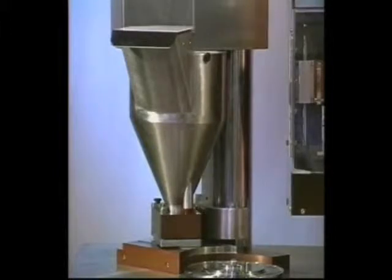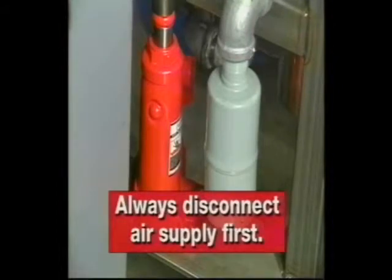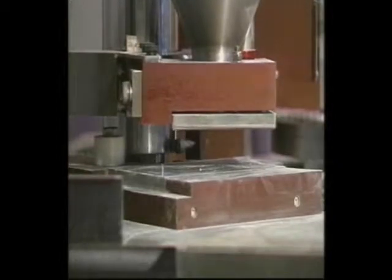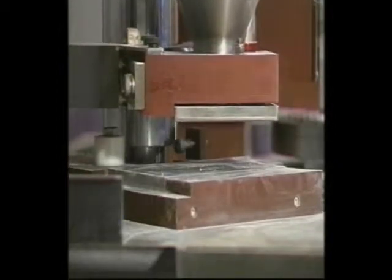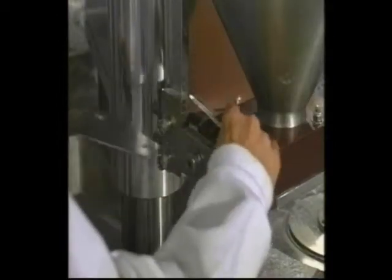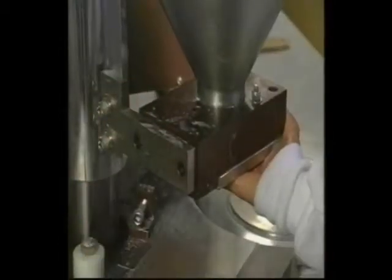Safety is our top priority, so always turn off the main power to the machine. You will need to jack the hopper up using a small hydraulic hand jack. Be sure that the small valve on the bottom of the jack is turned completely to the right. Adjust by using the small end of the jack handle. Begin jacking up the hopper until the top of the jack shaft reaches the bottom of the pillow block — do not allow the jack shaft to go through the pillow block, as damage to the hopper section will occur. Take the safety guard off of the hopper. Keep one hand underneath the powder shoe and remove the screws holding it, then set the shoe to the side.